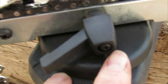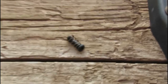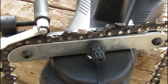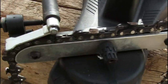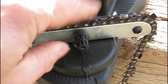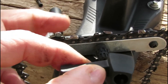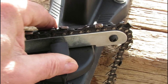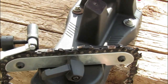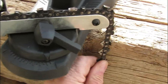There is a spring just behind this screw, and then there's a knurled plastic fitting — I will show you that. There's the screw with the spring, there's the knurl, and this is the handle. You'll probably want to make this fairly snug by hand, turning it clockwise, and then putting this back on with the handle to the left. Then put the spring-end screw back in. The chain is nice and loose — tap it down a little bit, tighten it with the clamp, and you have it nice and snug.